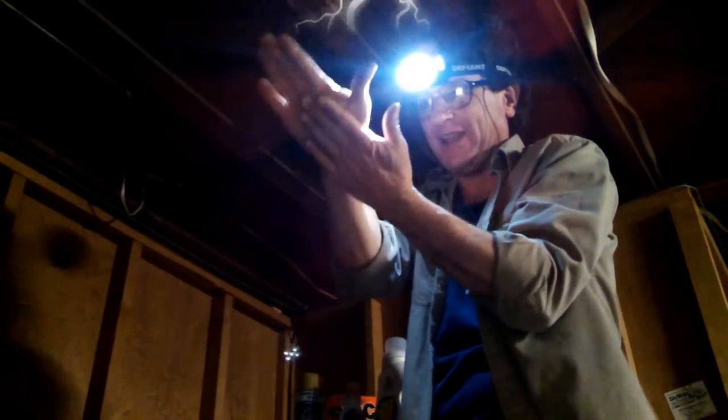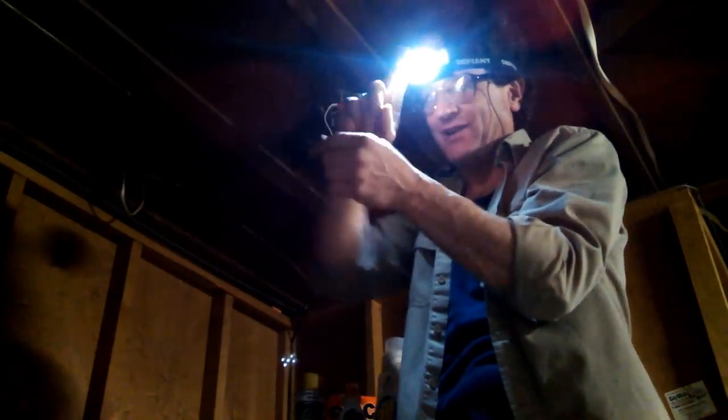Okay, so I found it. We re-pigtailed it. No big deal. It was those white wires. They just weren't all the same length. So even when the wire nut was on, there was one short. Fixed that up. And I tucked all of those wire nuts back up in the box there.